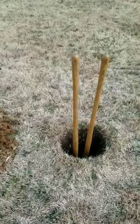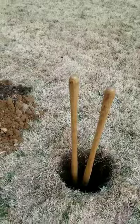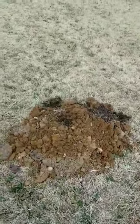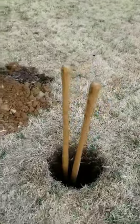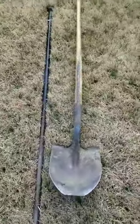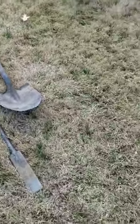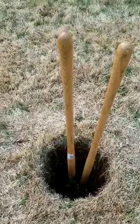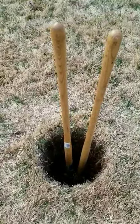I'm in the process of digging this hole. I have to go down 48 inches and right now I'm down about 30. I'm digging by hand — it's springtime and the dirt is very moist and easy to dig through. For this process I have a post hole digger, a shovel to shave the sides down to the required 12 inches, and a digging bar which is absolutely necessary. If you're going to dig this hole by hand you must use a digging bar. A post hole digger will not do it — it'll take forever.